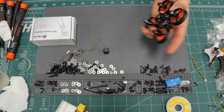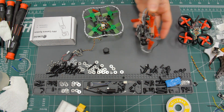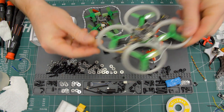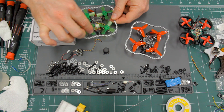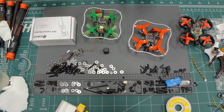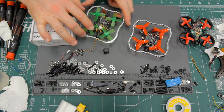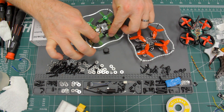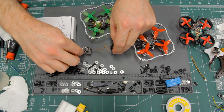I got frustrated with motors burning up on these little whoops, so I decided I wanted to build some brushless whoops. I built these — these frames are also made by FlexRC, called the Nano X and the Pico X. I made two versions: one with 0703 motors and one with 1102 motors. These were a little heavier than ideal for good flight times, so I wanted really lightweight camera VTX combos that also stayed out of the way of the props. The camera and VTX on both of these sit underneath the path of the props, so I went with the TX-01S.